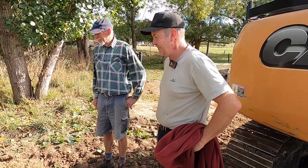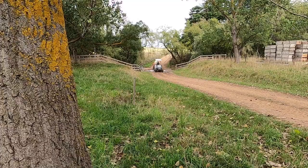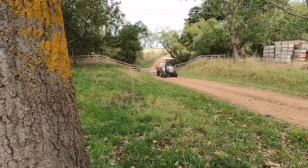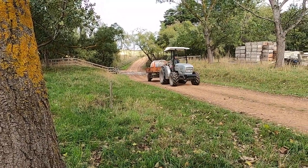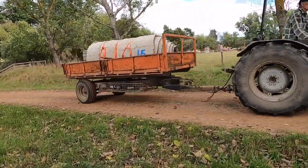You find after track rolling it you still get about another 50mm of compression with the clay after using the wheel. I think now, Alan, if we can get a bit of topsoil and subsoil just to finish off. While Glenn put down some topsoil, Alan raced off to get the concrete matting and have everything in place before the operator needed access to it — being an experienced campaigner, Alan knows the benefit of having everything ready for your operator just when they need it.